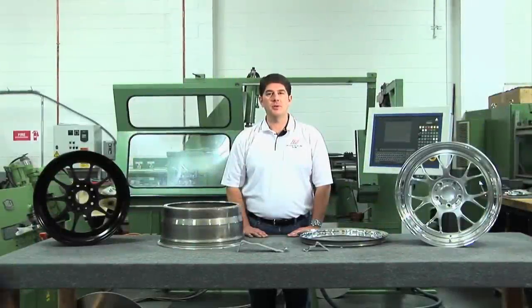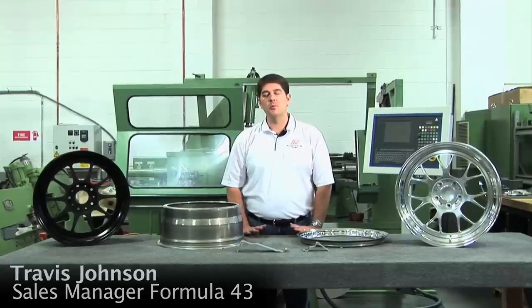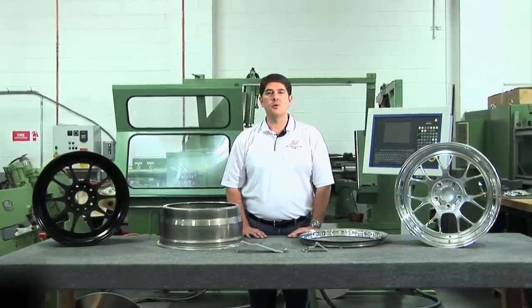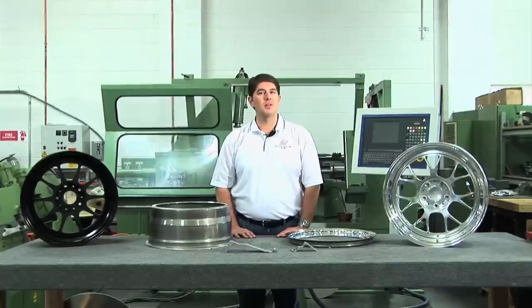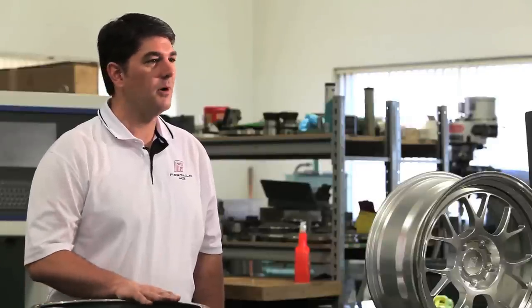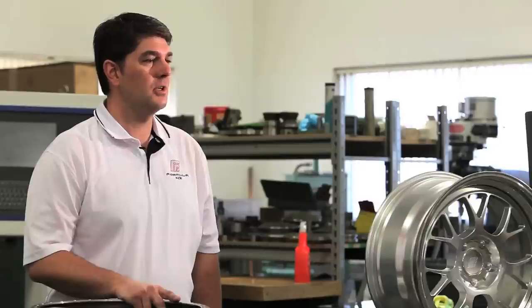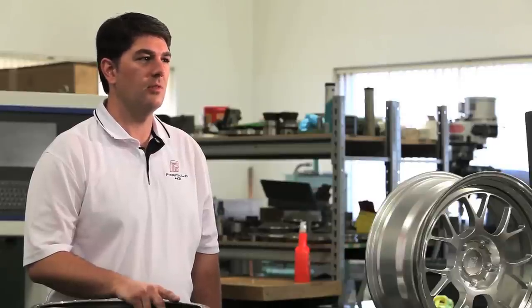Welcome to Formula 43. Today we're going to talk about Formula 43 and our spinning process and what's so unique about our modular wheels. Formula 43 is a Pacific spin form process developed by our company president over the last several decades of working with some of the biggest wheel manufacturers in the world. It's a three-step process where we spin the part, heat treat it, and then calibrate it using a Pacific spinning machine with four rollers. That's Formula 43.